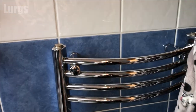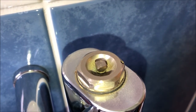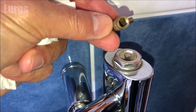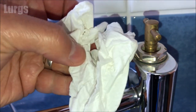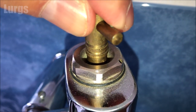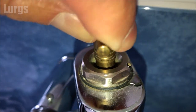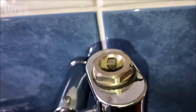Make sure you've got a tissue or a rag ready. What we'll be doing now is gently unscrewing this nut here, which releases any air out through that hole on the outside. Don't unscrew it all the way — you don't want that nut to come out, otherwise you're going to get water spraying all over the place. Just turn it very gently anti-clockwise and you'll hear some air start hissing out. There we go — as soon as the water starts spurting out you can close it down, then just mop up that excess water with a tissue.